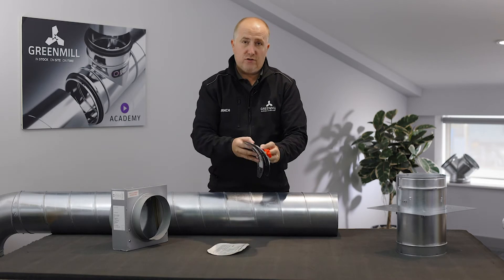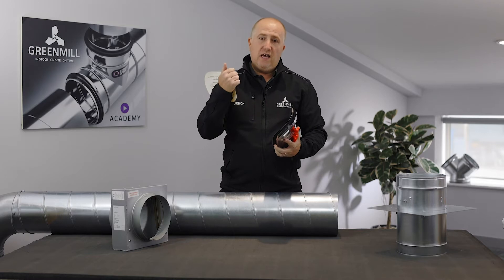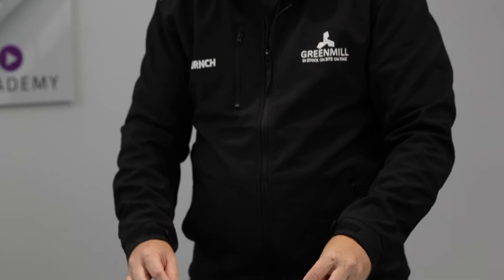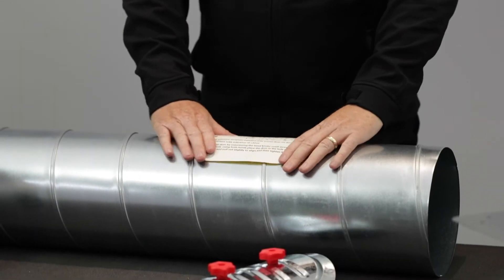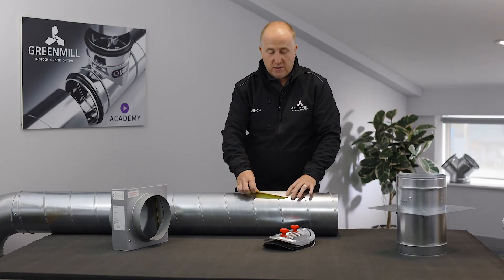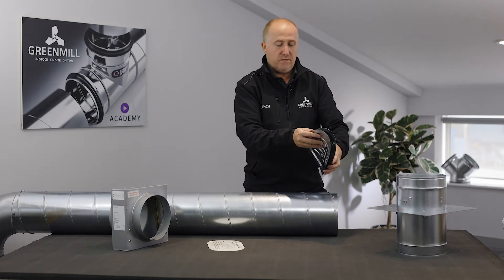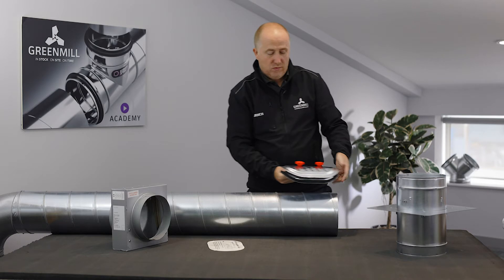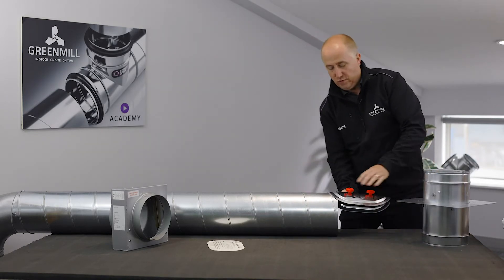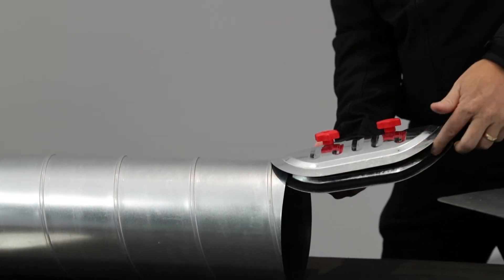With this damper you naturally need to install an access door to allow you to reach it for commissioning and visual checks. All these doors come with a sticker which you place onto your spiral duct in the position needed to gain access to the link. Sticker off, cut the hole out, release the handles, put that into the hole, and then sandwich it down with an airtight seal.